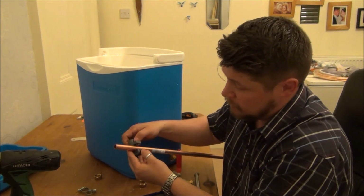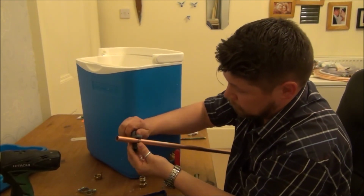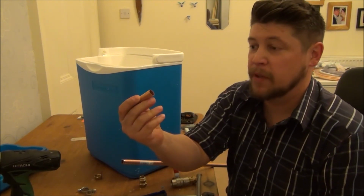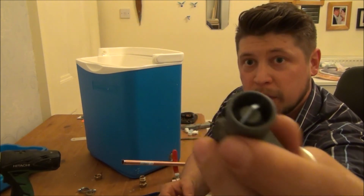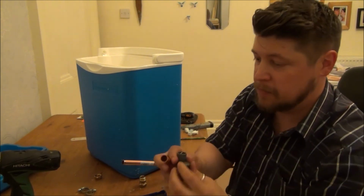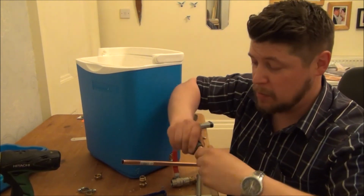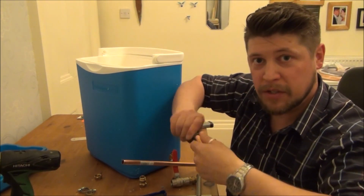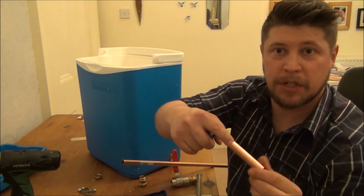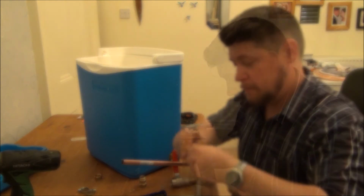just because it gives, as I say, a nice finish. There you go, pops off. Now what you will find in the end of this cutter, there's a little triangular shaped piece. You just take that and run it around the end of the pipe, and it just cleans up any burrs around the inside of that joint there. So that just gives you a nice chamfered finish on the end of that cut. Job's good. Lovely job.